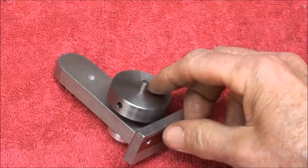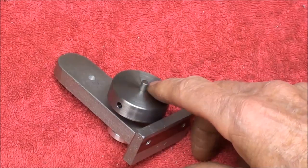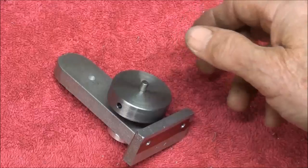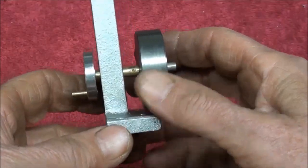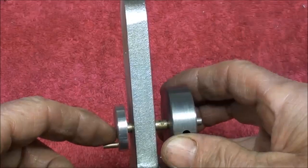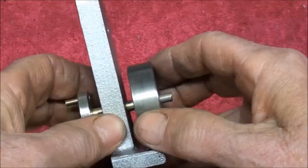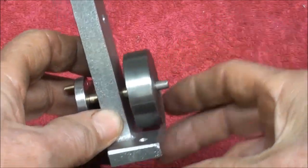I have temporarily mounted the flywheel on the shaft and just snugged it up a little bit. Later I will determine where the set screw hits the shaft by screwing it in hard enough to leave a mark. I'll put a little flat on the shaft, because if you run set screws in and deform the shaft it's very difficult to get the flywheel off. The brass bearing is slipping in and out of the hole — when I decide where to locate it relative to the cylinder bore I will Loctite it in place. It spins freely, and that's a nice heavy flywheel — about 1-5/8ths diameter steel and a half inch thick.